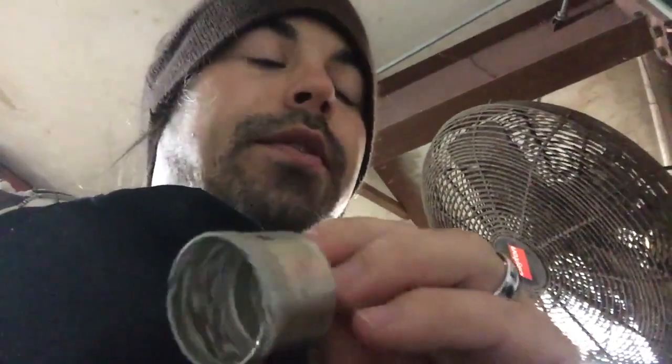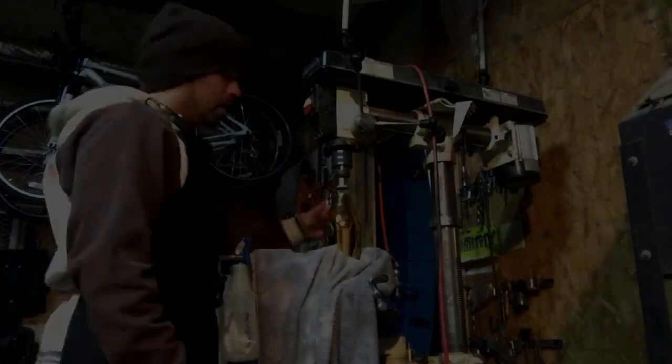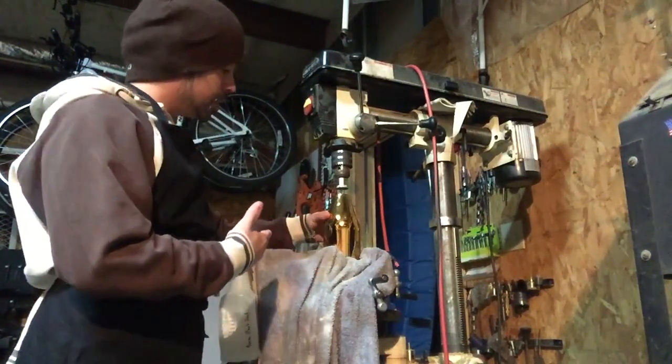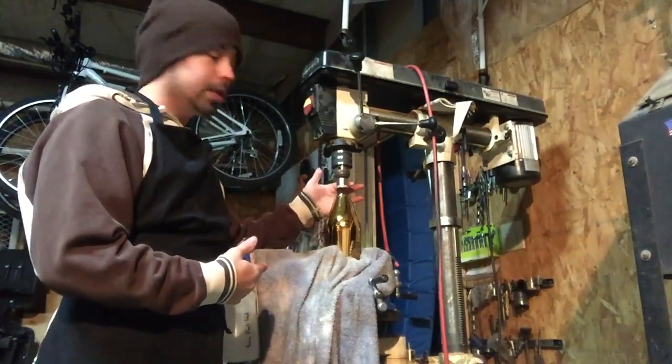You'll have to use a mic and measure your valve body for each of the hookah stems you use to put these together, but you'll get the hang of finding out what millimeter drill bit you need. We're going to take this cupped drill bit and form the correct inside diameter hole for our hookah stem. I'm going to chuck this bottle up into the vise — I already have the proper drill bit chucked up — and then we're going to drill it.